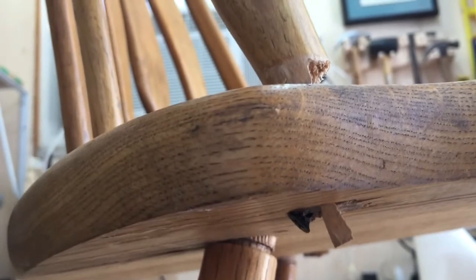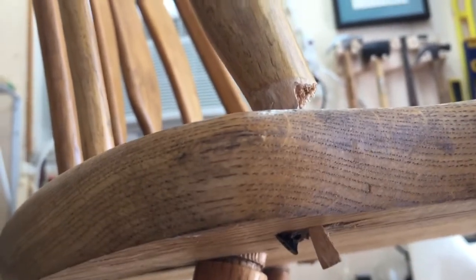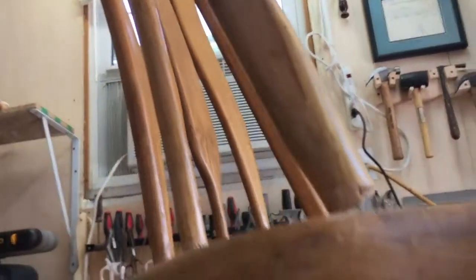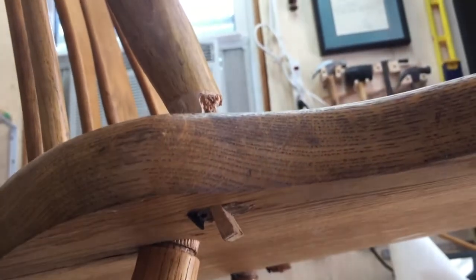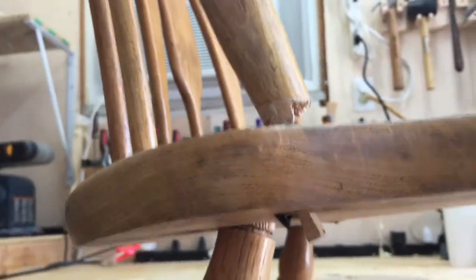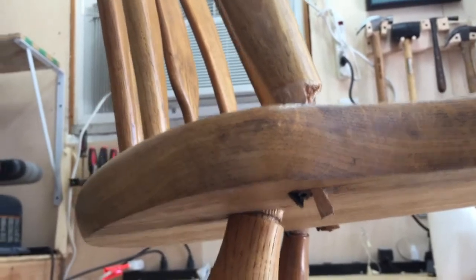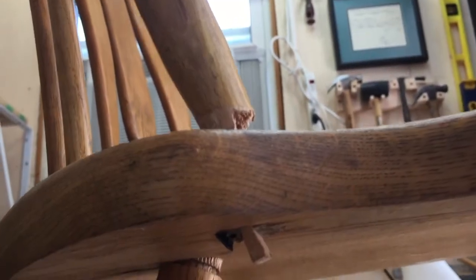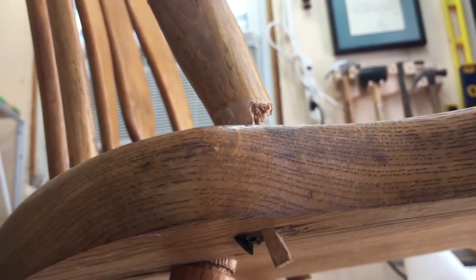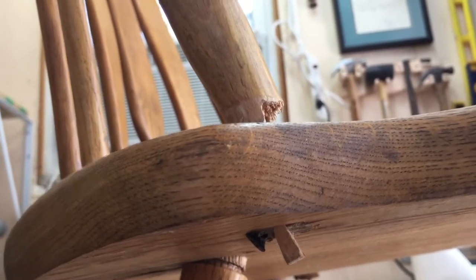Just my guess — I could be wrong, but we have to fix it anyway. I'm not going to show you the boring stuff; I'm going to clean out all the glue out of those holes. The fancy part will come when we take out that wedge, glue this up — I think we'll glue it up with epoxy — get it as strong as humanly possible, then take this awful screw out and drill up from the bottom into this piece and put either a screw or a dowel, epoxied in as well. Once we do that, we should have something very, very strong, never to break again.